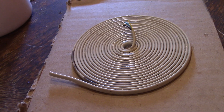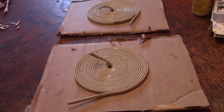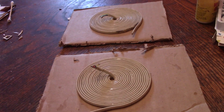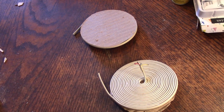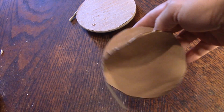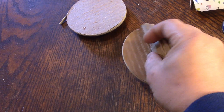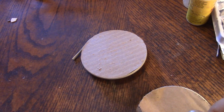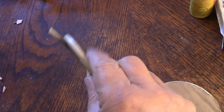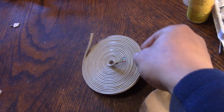When finished, that's a coil of 19 turns, and now I'll do exactly the same on this piece of cardboard. There we go — two matched coils. The next thing I've done is to neaten up the cardboard and then remove some of it by tearing it away to leave a flat backing. That means we've got the least amount of material in the way if we need to turn the coils around for better conductivity.